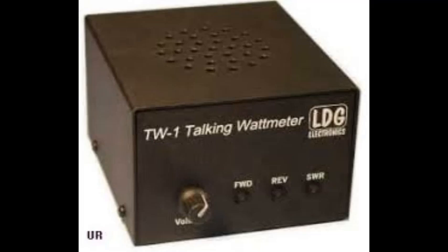In the box, you're going to get the power cable, which will not have any terminals on it. You can either put power poles or terminals on it, whichever you decide to do, to hook it to your power supply. If you set it down in front of you where the knob and three buttons are facing you, reach to the back on the right — your first SO-239 is going to your antenna, antenna tuner, or amplifier, whichever you have in line. The next one over to the left goes to your transceiver, your radio. And the next one over to the left of that is your DC power jack.